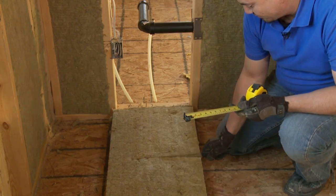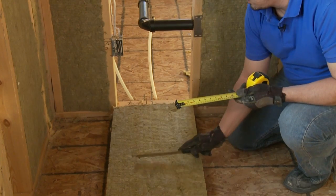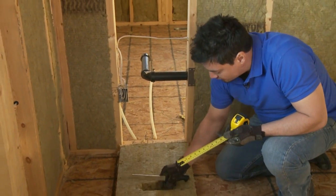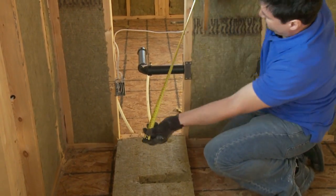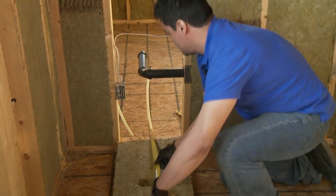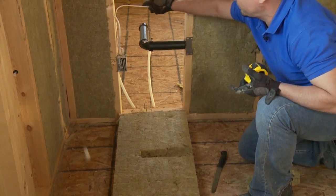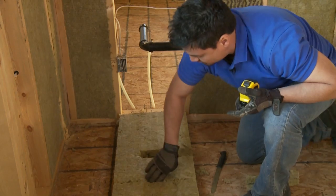I'm going to cut to the center of the bat, and like last time, because it's a big obstruction, cut a V notch about 1.5 inches from the line, digging it out. It almost feels like digging out bread, when you don't want all the bread in the middle, using also a bread knife. Now, our wiring, we are at about 24.5. Again, score it to about the middle of the bat. And because it's wire, again, it's not a very big obstruction. You can just sort of relax the opening with your finger. It should naturally just wrap itself around the wire.